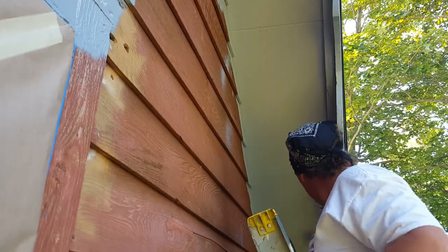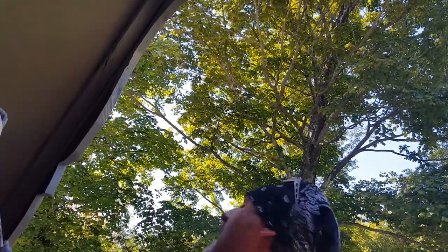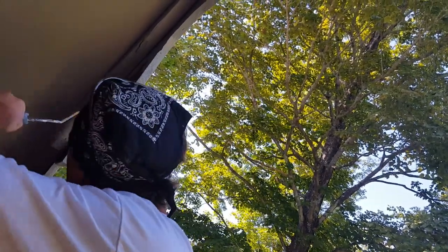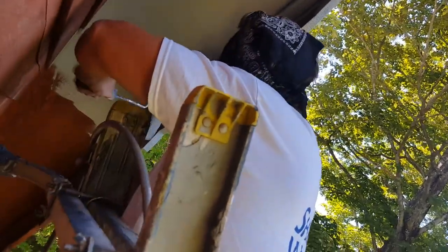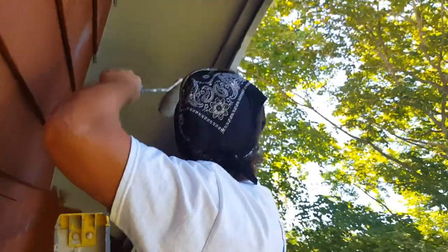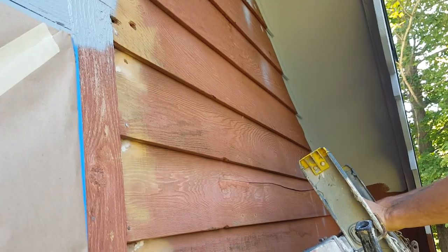Alright, like so. I don't know if you can film this, but behind here are holidays. Holidays are spots that are missed. And because I don't want to spray out into the world here and get overspray everywhere, I'll just fill it in with this. Just kind of get it solid. That real quick. All right, there's no more old brownie looking wood. It's all nice. Okay, let's revisit these woodpecker holes real quick. Highlighted woodpecker.